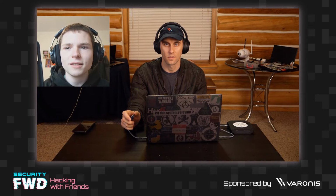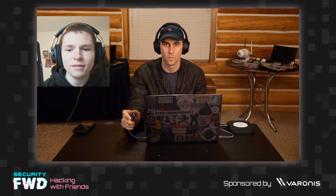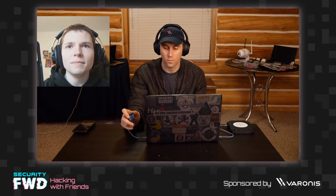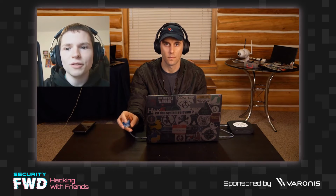The difference is the ESP32 is basically the successor of the 8266. It's more powerful, it has 2 cores, it's clocked higher, it has a lot more RAM. It's also a bit more expensive, but it's just a more powerful chip, and it can also do Bluetooth and some other fancy features they added in the software.